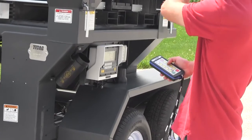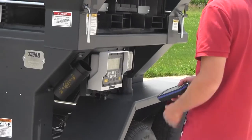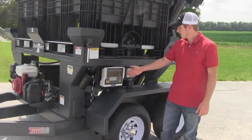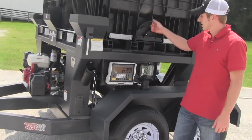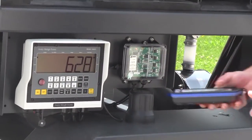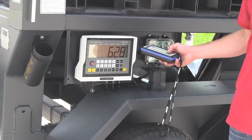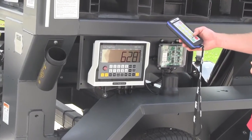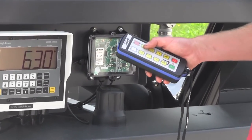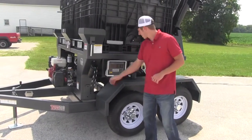You can fold the auger up and just press a button and your auger will run however long you want it to. This one is equipped with the scales. Right now we obviously have 630 pounds on here. But with your remote, this allows you to plug in how many pounds you want in every row, every box. With the push of a button, you can have that exact amount augered into every row — that's the remote system of the scales.